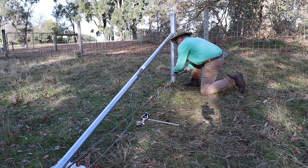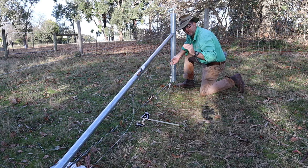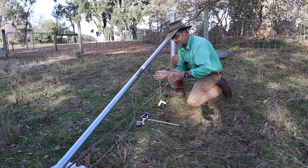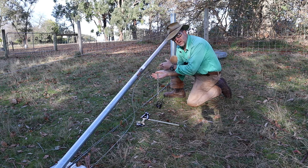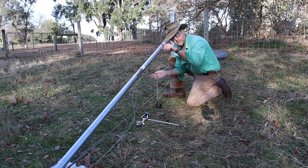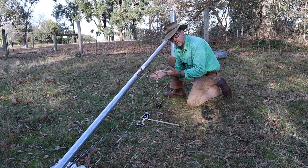Setting up your strainers to strain to a post is actually quite easy. Have your chain oriented 15 centimetres above or below where you want to strain off to. The next thing I do is run my hand down the chain. This achieves a few things: the chain's going to be where I want to work with it and nice and tight. When I run my hand down, I'm orienting all of the links in the same direction so that there's no twist, which makes it easier for straining. And I can feel any nicks or problems with the chain before I begin.